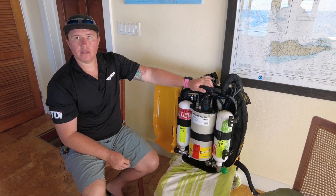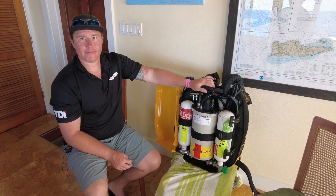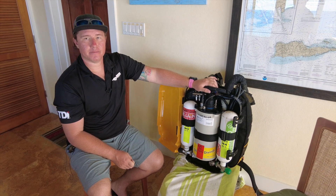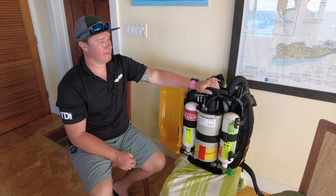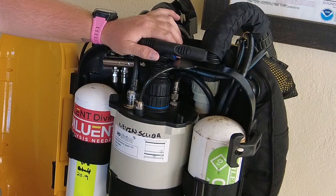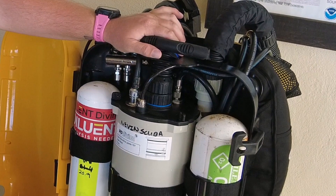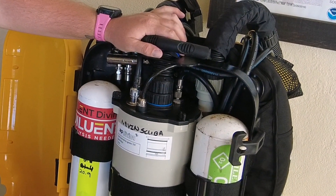This week we had one oxygen cell that wasn't behaving quite the way the other two were, so we ended up having some cell warnings — and that was a good learning experience to show that you continue to function even though one cell is not doing exactly what you expected. With the controllers, those are in a master-slave relationship. Controller one is master. Controller two is constantly watching controller one, and if it feels like it's not doing quite what it should, it will take over control of the system. Ultimately, we are able to shut controller one down and make controller two the master.